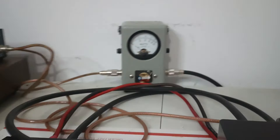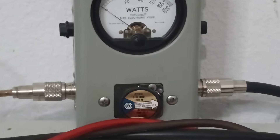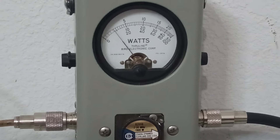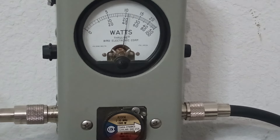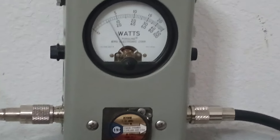Let's see how it stacks up on the wattmeter. Put average power first — thousand watt slug, bottom scale. So a little more average power, just a little bit over 400 on this one. And then peak-to-peak.